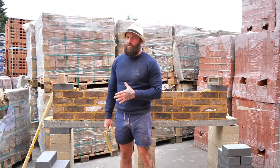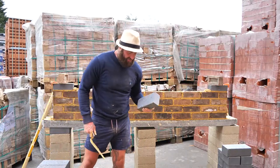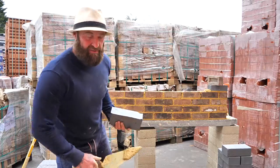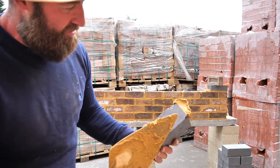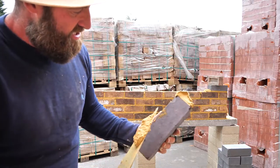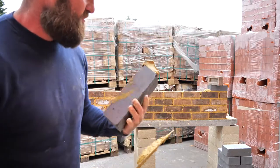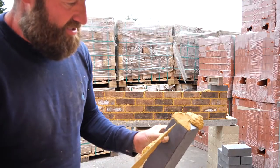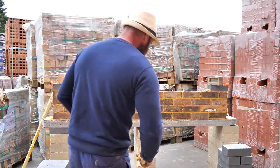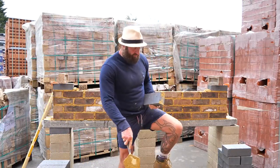Now I'm using a different brick, a different material. Just look at this closely. Just watch this. As you come up, any mortar on there, I'm going to try and do it wrong, it's called smears. So you could be just perping the brick up. See the little smear there? It's a hard brick to lay. So don't avoid them. Work with them.